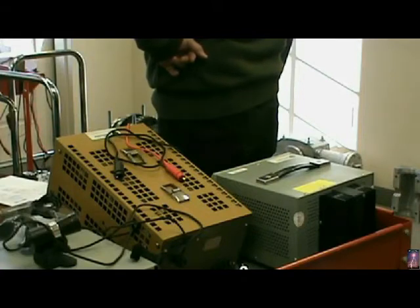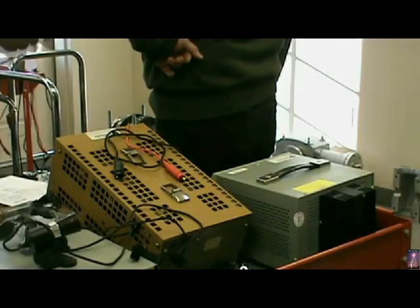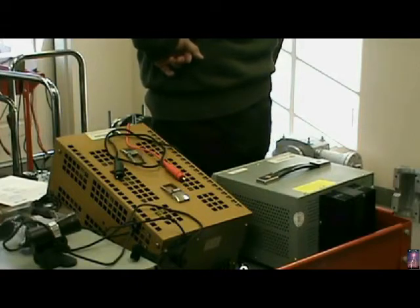It's a little bit like what we've done with the actuator test, where we now know that 4 IGBTs work great without the driver in there, and that the other ones work great but require the driver. Well, the drivers are another $1. So if we can get away without the drivers, we get back $1 in cost.